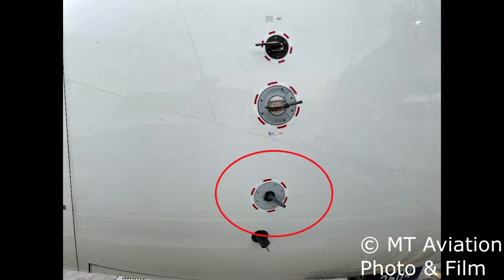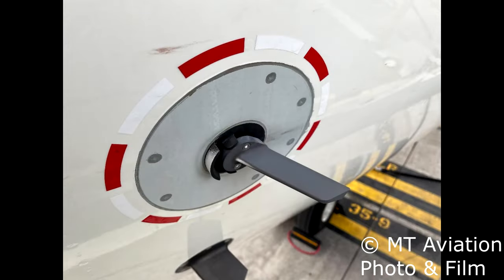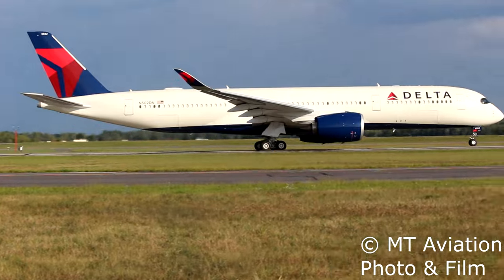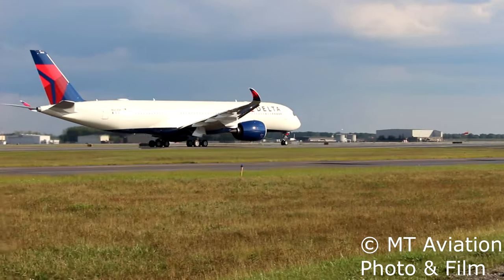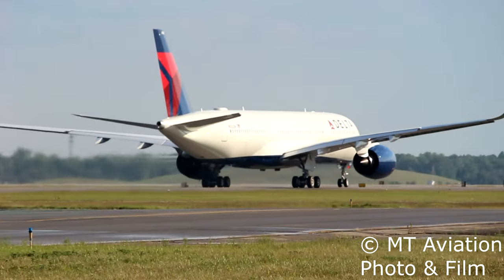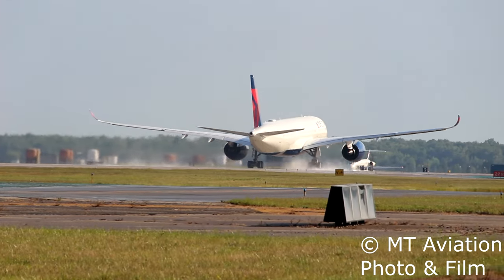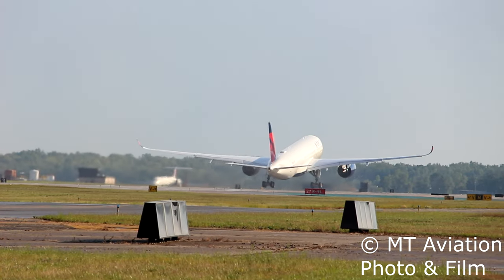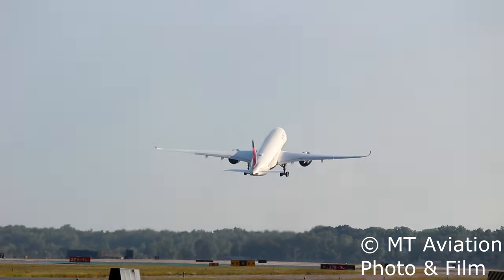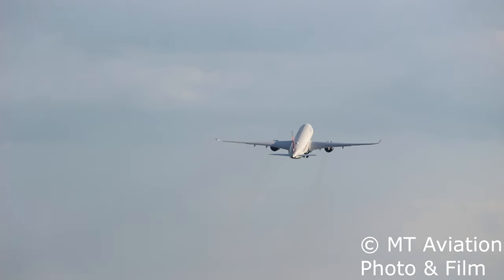One PFCS angle of attack probe, or AOA for short, is installed on the left side of the nose. Unlike the AOAs on the MFPs that we will cover, this is a standalone probe. The AOA probe works off the weather vane principle as well. As the nose of the aircraft raises or lowers as the aircraft climbs or descends, the vane is held at a constant level position by the air stream. The angle between the vane and the probe, known as the angle of attack, is measured and reported to the number one ADIRU and to the PRIM in the primary flight control system or PFCS. This data is used to compute the flight control laws and reduce wing loads during maneuvers or wing gusts as part of the load alleviation function.